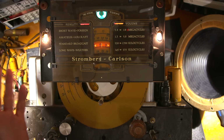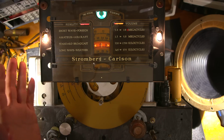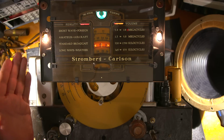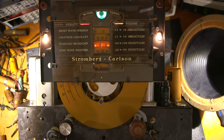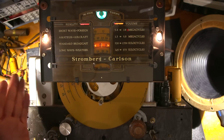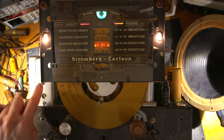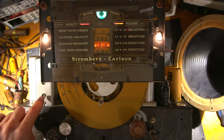So the magnetism of a metal screwdriver in there is not going to affect these. Now, a lot of the times, if you're going to be adjusting these, you can use a metal screwdriver on the capacitors, as long as it's insulated and you know it's not live. It's the better thing to do, because you'll break your tuning tools in these. These are just big screws screwed into a capacitor here.